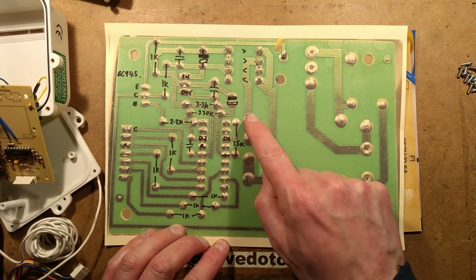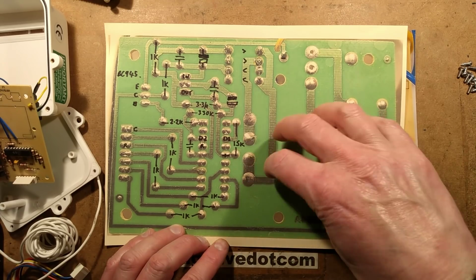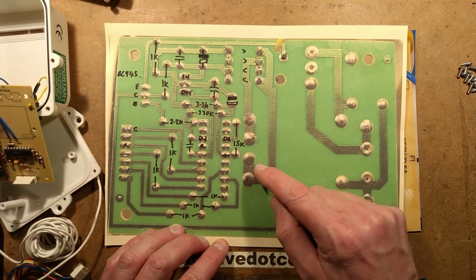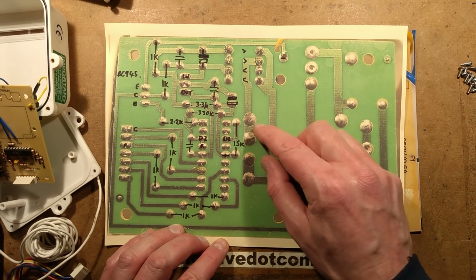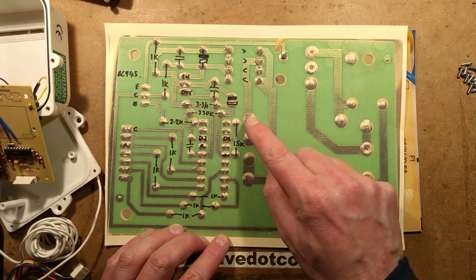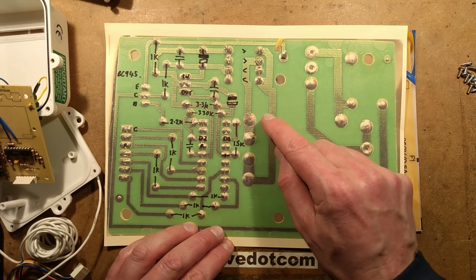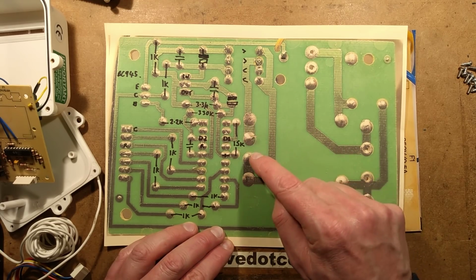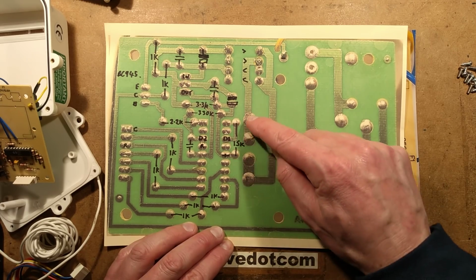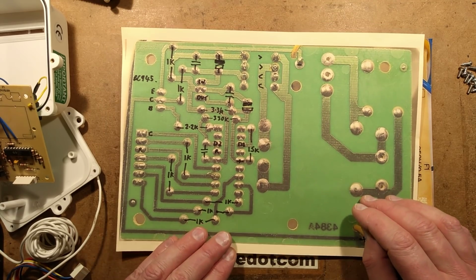The only odd thing about the transformer is the pins on the other side. Normally, on a transformer, you'd have different pinnings so the transformer can't be accidentally turned around during manufacture. So it would make sense to have a couple of pins in the middle, or the 4 pins that's sometimes used with dual windings, but you couldn't really use the double winding here because it would just short them both out. Normally, on a traditional transformer with 2 secondary windings, you'd have one between these 2 pins and one between these 2 pins. You'd either connect them in series with the connections coming off either end, or bridge them across in parallel for higher current, lower voltage. What else is there worth mentioning here?